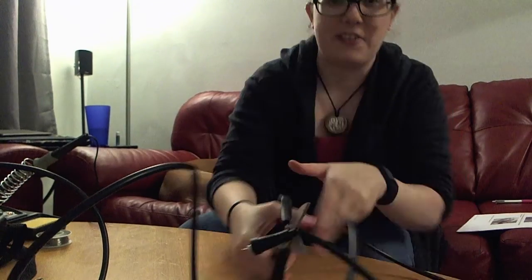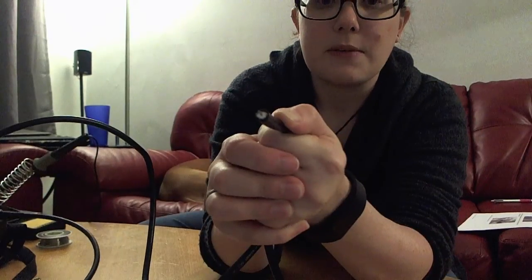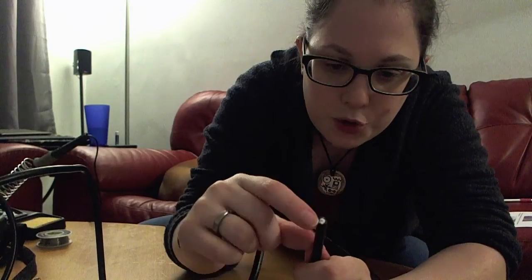These are quite literally my kitchen shears, but you should probably use a wire cutter if you can find them. So you've cut the end off a coaxial cable. What you see on the inside is you have a copper conductor in the very center, surrounded by white insulating material, surrounded by some more metal material, and surrounded once more by the black insulating material. You're going to strip off about 2 inches of this black insulator material, being careful not to ruin the metal mesh underneath. You can use a knife, wire strippers, or wire cutters — whatever you're comfortable with.